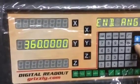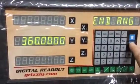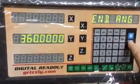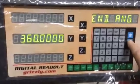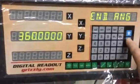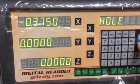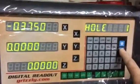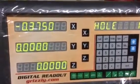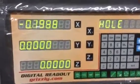If you don't zero the starting angle, I think this creates problems — I don't want to have to make two moves right off the bat. I want to go X or Y one way and that's it. So we're going to leave that at zero. It'll ask for the ending angle at 360. I don't completely understand that, because we're not going to drill a sixth phantom hole at the same spot we started. So we've done five holes, start zero, ending 360. When I hit the down arrow one more time, it says we're ready to drill hole number one — offset to minus 375, so we're going to go three eighths of an inch to the left on the X axis.